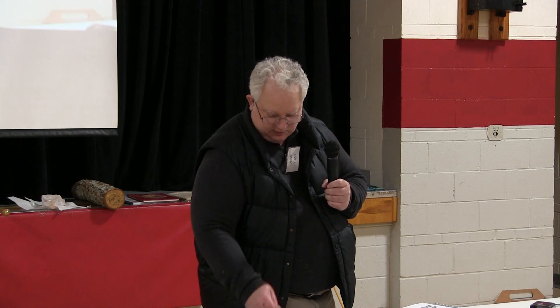This is a hollowing spokeshave. It works more like a carving gouge and works really well for hollowing out seats of chairs. Then I have a couple more that I didn't bring — one is a round-over plane for really making round wood handles and tool handles, and the other is a larger version of the curved one, which works even better.